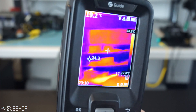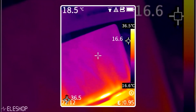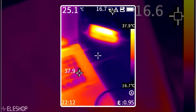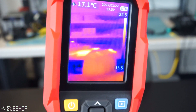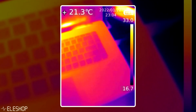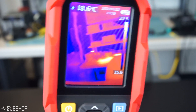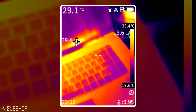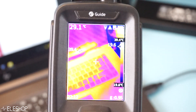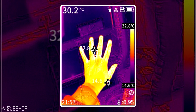The infrared images of the PC210 look more accurate and sharp than those of the Uni-T. Furthermore, the PC210 performs better when moving the thermal camera — the Uni-T shows quite some ghosting when you move it. Like a single lens reflex camera, every thermal imaging camera has a shutter, used to do a calibration a few times a minute, which causes the image to stop for a while. This is perfectly normal.